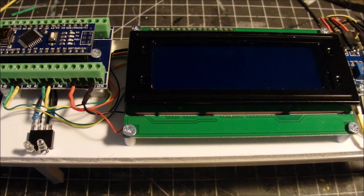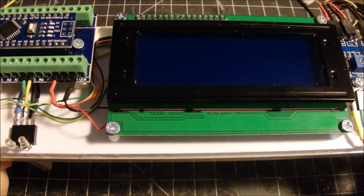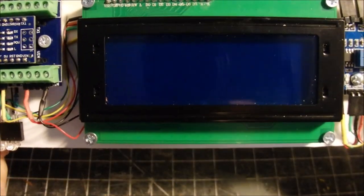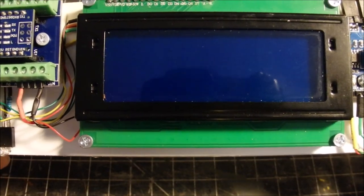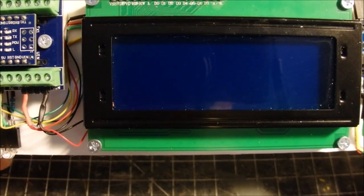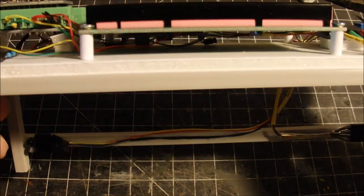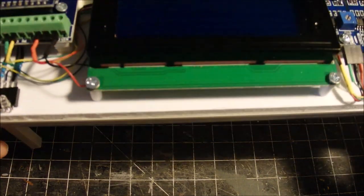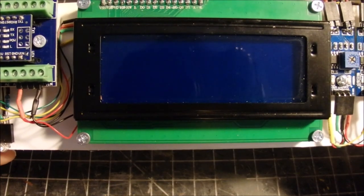Okay, well, in review, there's a few little things I still need to figure out. You may have noticed when I ran the test on the layout, I picked this up right away in order to read the display. If you let the train continue to run under this thing, you're going to get a display for about 5 seconds, and then you're going to get some erroneous readings because the sensors will be set off simultaneously with the train as it continues to pass underneath. So you've got 5 seconds to read the thing before it resets.